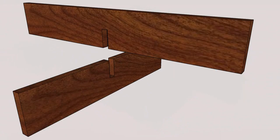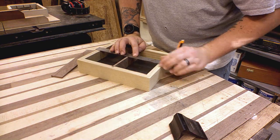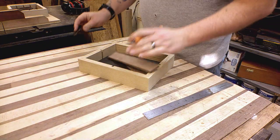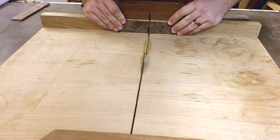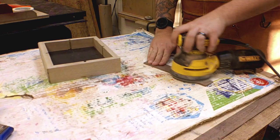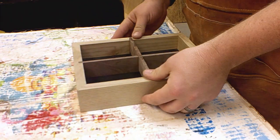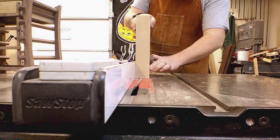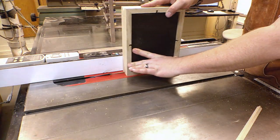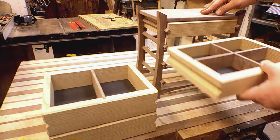The drawer dividers go together with half laps, so I will use the drawers themselves to lay out the cuts. First, I make a mark along the tops of the dividers using a ruler for a liner. Then I use a saddle square to transfer the lines to the face of the dividers. With my saw depth set for halfway, I simply cut out the areas in between the pencil marks. I'll give the dividers a final sanding now — these dividers fit nicely. Now it's finally time to cut the 45 degree dados for the diamond drawer guides into the drawer sides. With the blade tipped to 45 degrees, I simply make a pass through the side of the drawer, spin it around, and cut the opposite side. I really took my time setting up those cuts to ensure a nice sliding action.